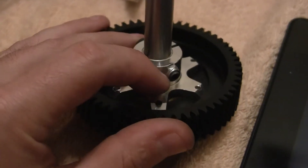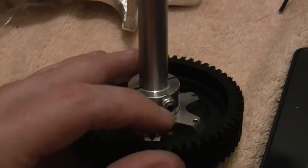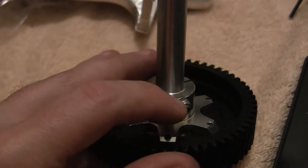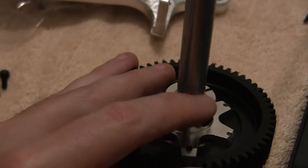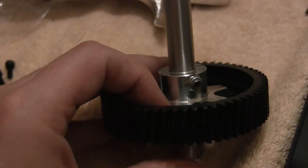Back it up — there we go. You can see how the metal deformed a little bit. What I did is I took a wrench and held the nut in position when I tightened it, so it would pull it into the channel. Because if you don't do that for that initial tightening, it'll probably just tear that aluminum out of there. You can see how it's real thin, so just something to watch out for.